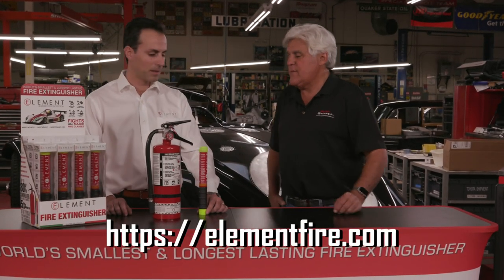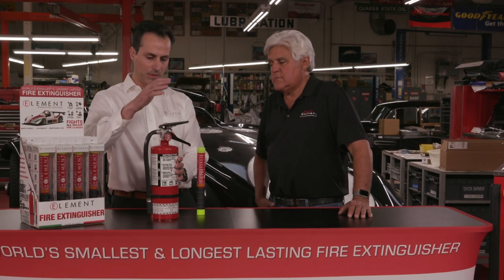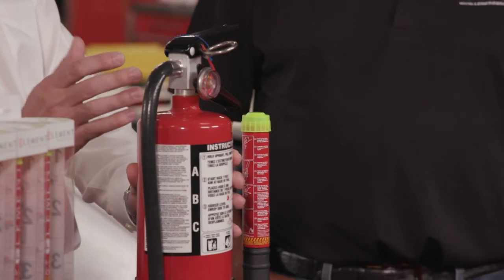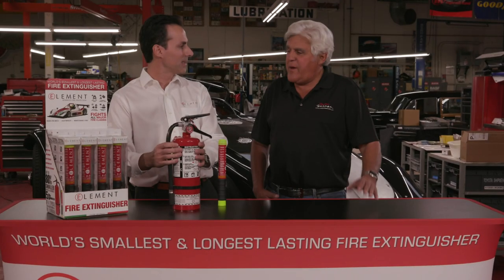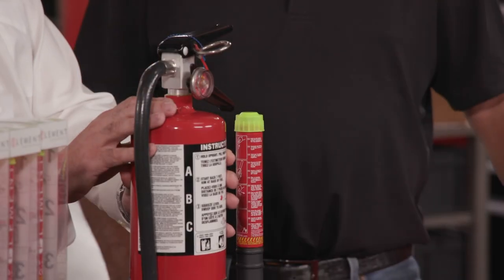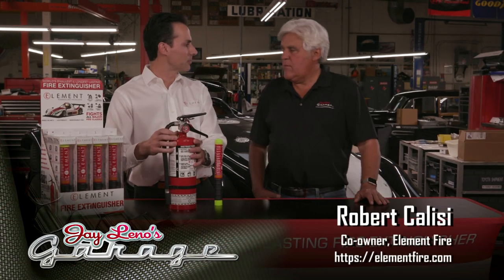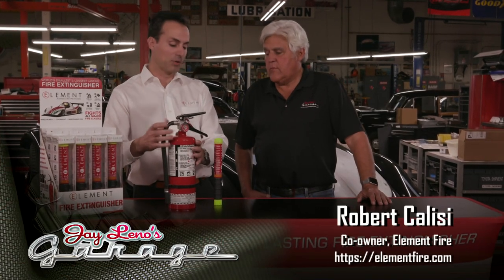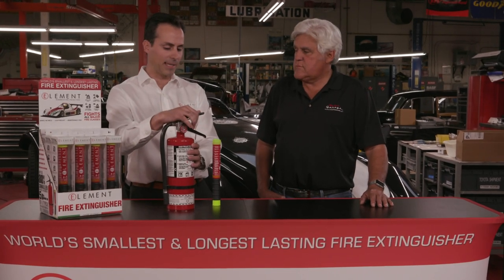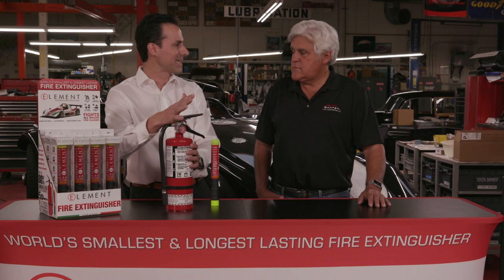Tell us exactly what you have here. Well, what we have is a completely different type of fire extinguisher. A typical five-pound fire bottle actually weighs about seven and a half pounds. One of the things about these bottles is they're a compressed gas cylinder. They make a terrible mess, as you probably know — though there are some clean extinguishers as well. And the discharge time on an extinguisher like this is approximately nine to eleven seconds, and they start losing steam after about six.